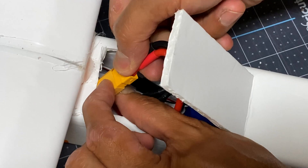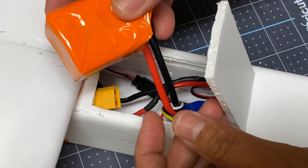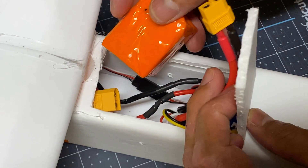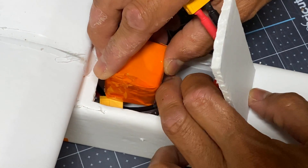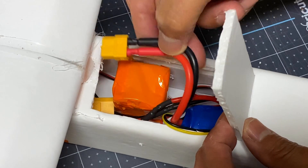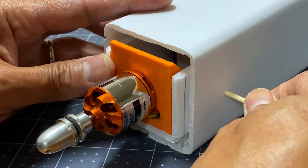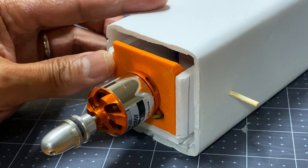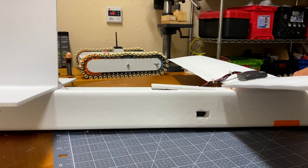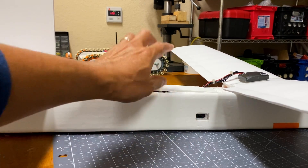I also made sure I have access to the power cable. A weight is added to fine-tune the balance. I also added a barbecue stick to fix in place the housing. A hole is cut on the side to access the flight controller with micro USB.